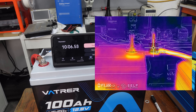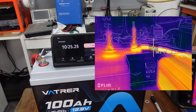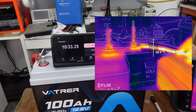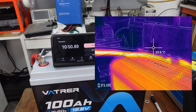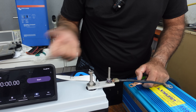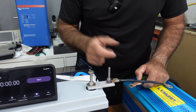It has been 10 minutes. I'll now disconnect the heater and pick up the thermal camera. As you can see, everything is basically normal. The cable is a bit hotter, but it's not even hot to the touch — this camera makes it look much hotter than it is. It's only at 40 degrees Celsius; my hands are hotter than this cable. So yes, this is the connection made directly to the bus bar. Now that we know it didn't overheat during those 10 minutes, let's make a bad connection.